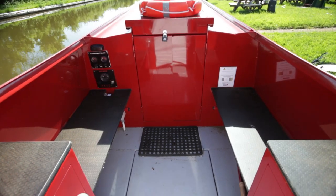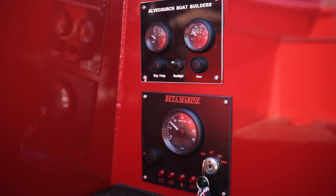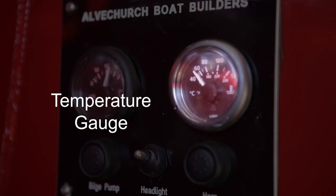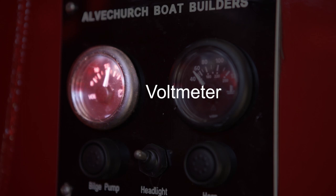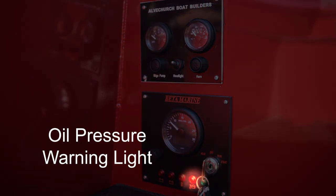The rear deck contains all the controls for driving and controlling the boat. The control panel shows information about the state of the engine and batteries with various gauges and warning lights. The normal running temperature is about 80 degrees centigrade — if the temperature rises above 90 degrees centigrade or the overheat buzzer sounds, other than at startup, pull over and stop the engine and refer to the manual. The voltmeter should be in the green sector while the engine is running — if it goes into the red or the charge warning light comes on, again pull over and refer to the manual. If the oil pressure warning light comes on at any time, follow the same procedure.